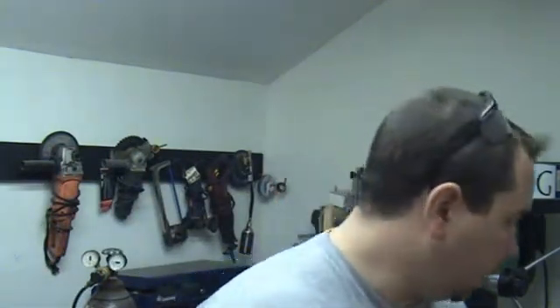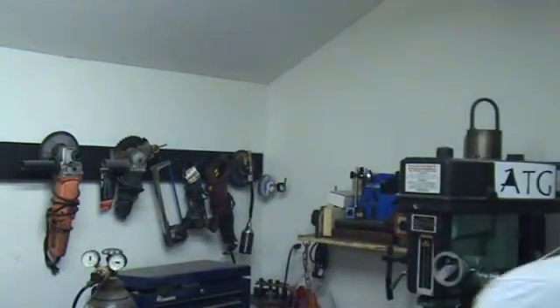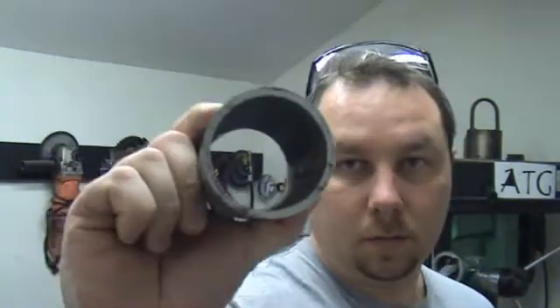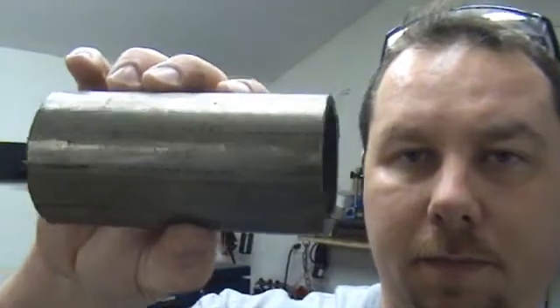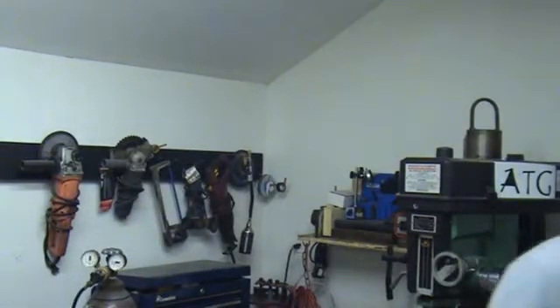I need to make a handle for this. So basically what I'm doing is I'm cutting this 2-inch tube, and basically the die is going to sit inside the tube like so. My band saw is not cutting this square — it looks square but it's really not, it's a little off square. So what I'm having to do is just face it a little.